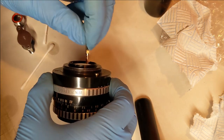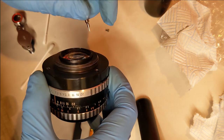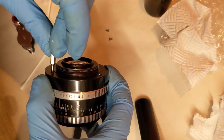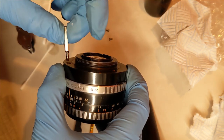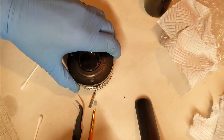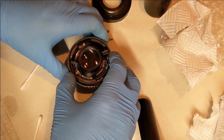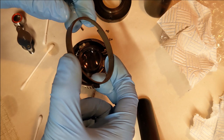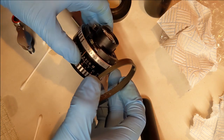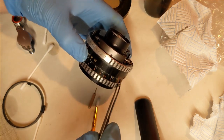I've just noticed something — that's why I'm taking the back off this lens. There's a ball bearing on the table, and that ball bearing must have come from inside the lens. I know it's not the aperture ring ball bearing, so it must be from this selector switch for manual and automatic. The ball bearing would normally fit in a tiny little hole at the side which contains a spring and some oil — and there we go.